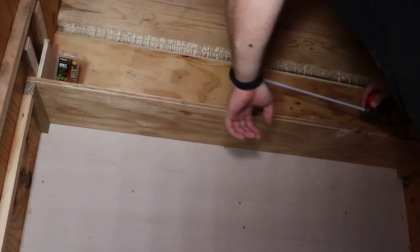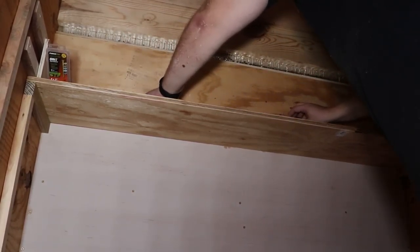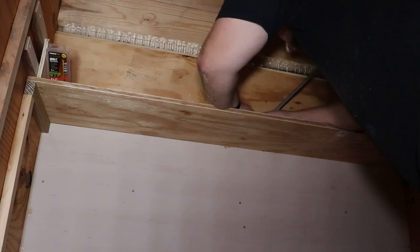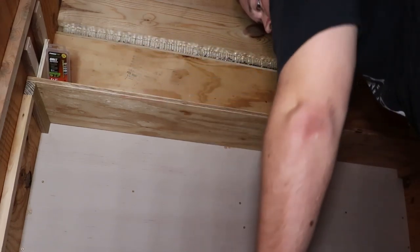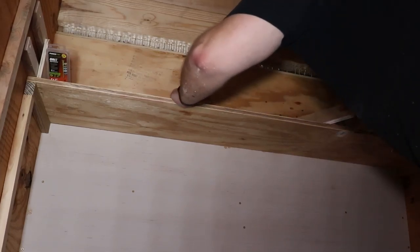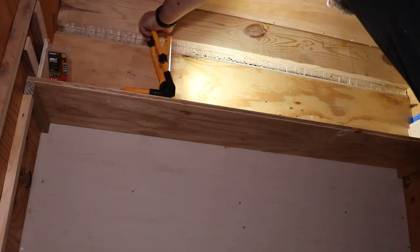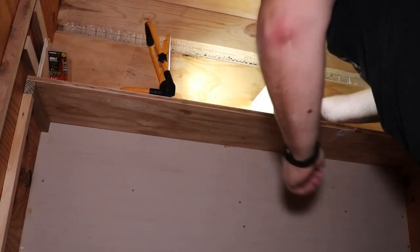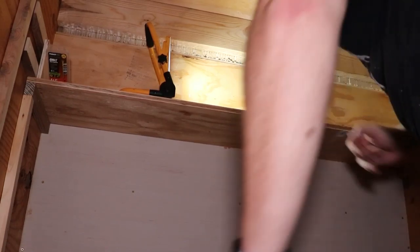Transitioning into screwing in that middle divider, all I'm doing is trying to measure out the center. I use the phone to calculate and all that stuff. The big thing is, the reason I went from 4 dividers to 3 was mostly for aesthetic purposes. I just felt that if I used 4 dividers, but for some reason they didn't line up properly with the cabinet, it might look odd. So cutting it from 4 to 3, I'll just have the outside and the center, and I won't have to worry about that whole imbalance deal.